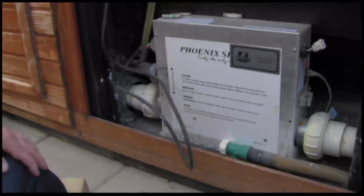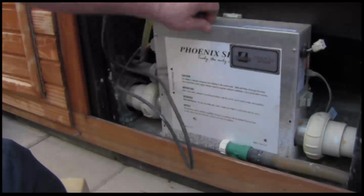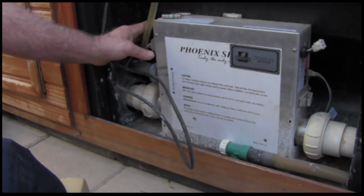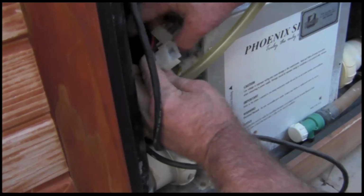When you have a popping GFI, the first thing you want to do is disconnect any connections to your main brain, and if the GFI resets, then you know that it's one of the items that you've unplugged. So let's start unplugging. That shows a little glare of overheating there. In fact, both of them do.